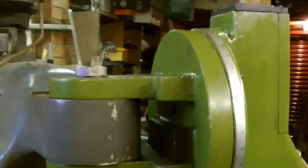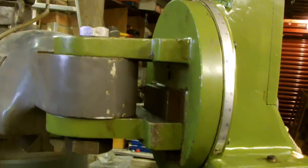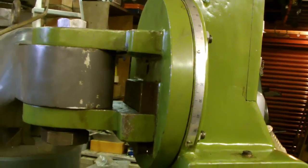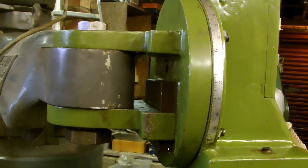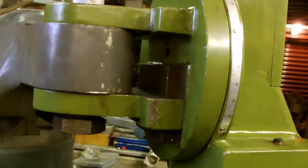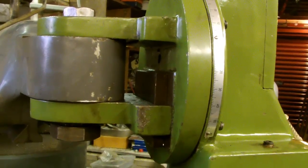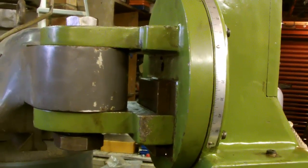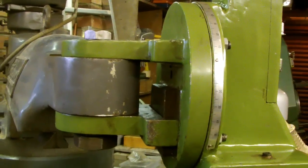See the back of the Bridgeport ram - as you can see, it's like that. And the fitting - I never knew this until it arrived. I thought this was one solid piece and just a perfect fit for the Bridgeport. But you can see it's on a dovetail, which I thought was quite clever. The other side has got two cap screws that lock it in place wherever you need it to be. So maybe this is designed to fit quite a number of machines - it certainly fits the Bridgeport.